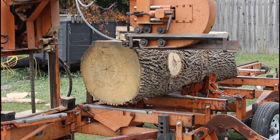So until my blade tensioning gauge comes, I turned the tension up 1/2 revolution. I'm going to try that and see if that helps, but I don't really know where I'm at in terms of the proper tension on the blade, so I don't want to get too carried away and break the blade, but I guess if I do, I need to experience that too. So here we go.